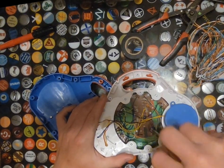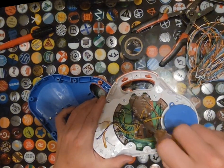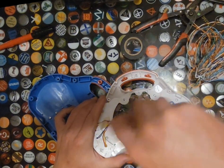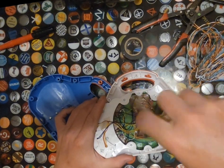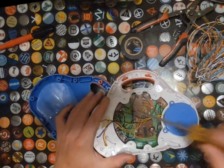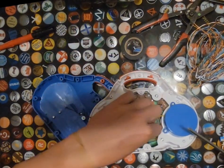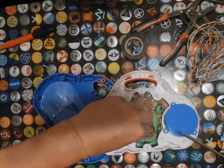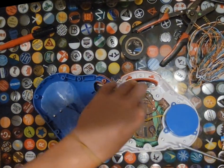And then there are multiple circuit boards in here. My guess is that our tempo tone control is going to be on this integrated circuit. A lot of times in these semi-newer instruments, when you see these integrated circuits, what they are is they're taking the place of the actual resistors. So on the R1s and R2s that we typically hit up, they get sort of replaced by these integrated circuits. But that is yet to be seen. They also may be using both. So we'll see what happens.